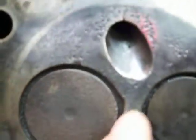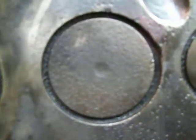And obviously cylinder number 5, I don't think I've ever seen one cracked in 2 places like a Y like that. It's still not showing through very good, but anyways, this crack goes up and it goes up to the right, up inside, and then one just goes straight up and all the way across here. So in a nutshell, I need a cylinder head.